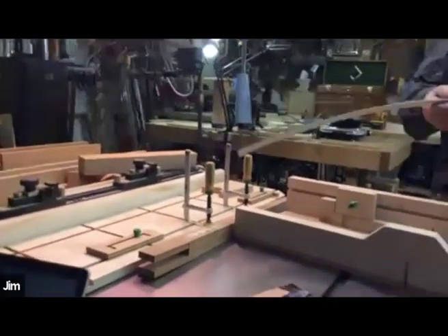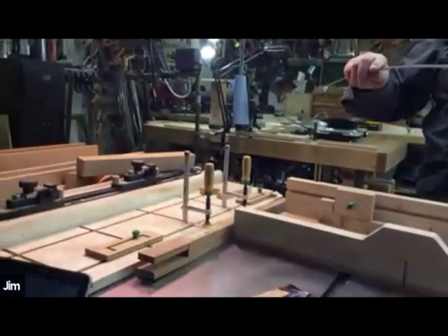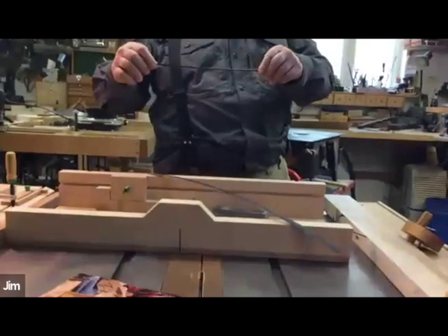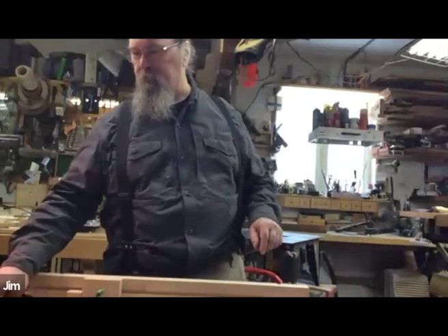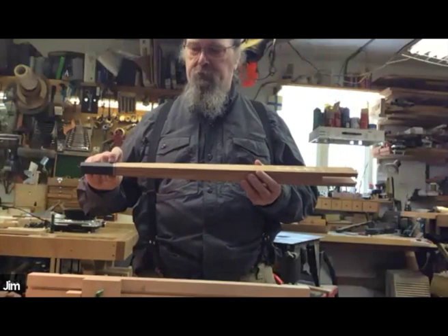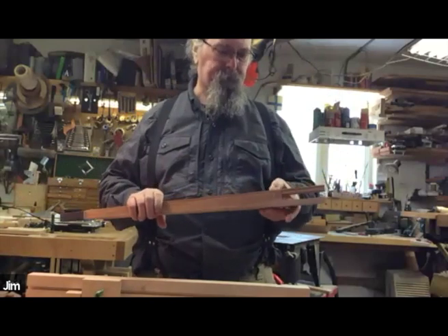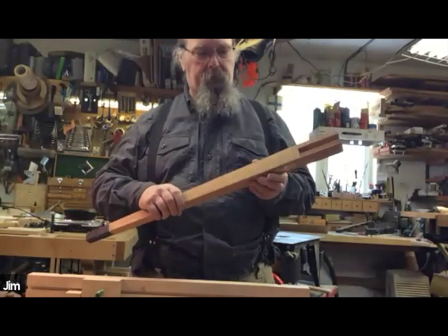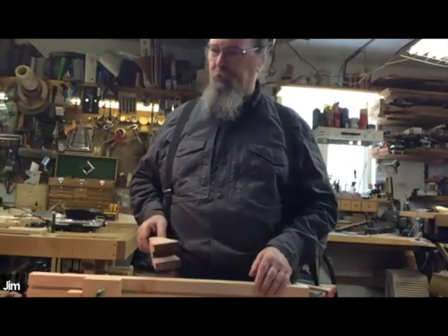The stringing is black and white. You laminate layers of holly and dyed poplar to get this 1/16-inch thick stringing. Then you take a router and route a groove in the mahogany leg where the stringing goes. There's also a curved arch up on top — it's quite the process and it gets quite involved.